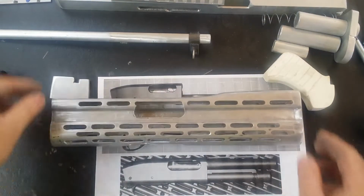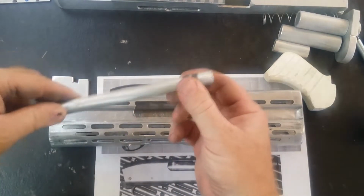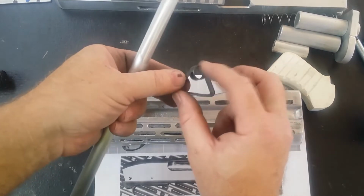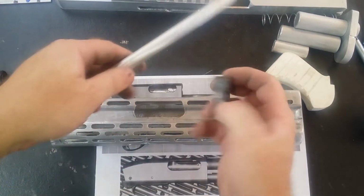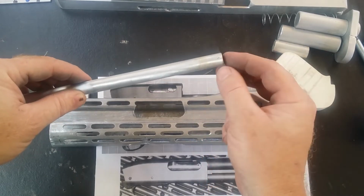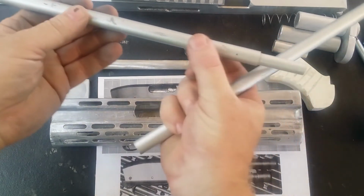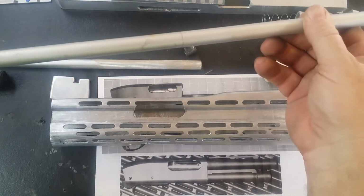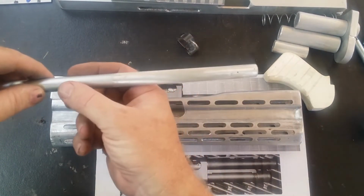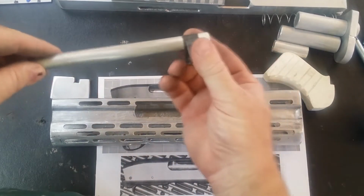So whilst I'm briefly talking about barrels, I did find a piece that was suitable for the Thompson barrel. This can be a little bit trickier to find because the outside diameter of that particular metal piece is a fairly standard size of about 16mm, which tends to be the standard size you find for this same sort of aluminium tubing. What I ended up finding was a piece of aluminium tube that's used in tent poles, and what that's made up from is a piece that's been spot welded inside there, so that can connect to become an extendable rod. But what I found is by cutting that off and sanding that down, it gives me a piece that tapers towards the end, which is exactly what the original barrel did, and that ends up being a perfect fit for that piece that goes on there.